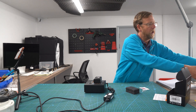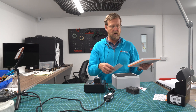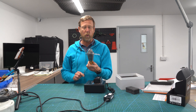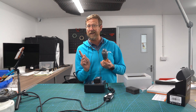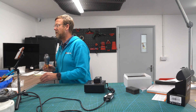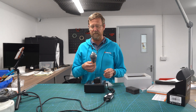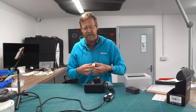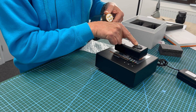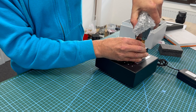We're going to do a couple of tests today. This is the Psvane Mark II Treasure valve. We're going to test two — these are supposed to be a matched pair, so let's see if they really are. I'm not going to touch the glass. The 300B valve base — the heaters are the fatter, bigger diameter pins. Can you see they're a bigger diameter? That correlates to the bigger diameter holes there. Insert it in like that, put the protector over the top, give it a little wiggle, and push it in.